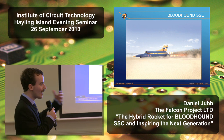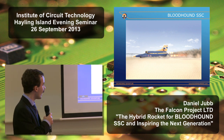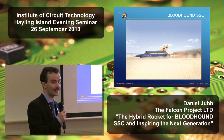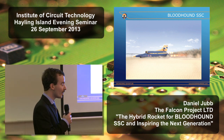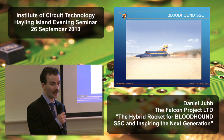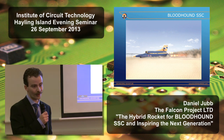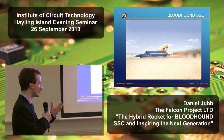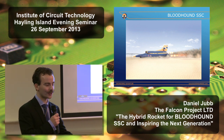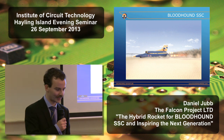And through many evolutions of the design, what they have come up with is the Bloodhound, and this car actually has three engines. We have a jet engine from a Eurofighter Typhoon, which gives us 20,000 pounds of thrust on full afterburner. We have the largest hybrid rocket that's ever been produced in Europe, which gives us 27,500 pounds peak thrust, 25,000 pounds average thrust. And we actually have a Cosworth Formula One racing engine in there as well. It doesn't drive the wheels in any way, it purely exists to pump our oxidizer, hydrogen peroxide, into the rocket engine at a rate of 1 ton in just over 20 seconds.